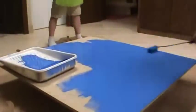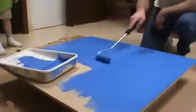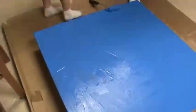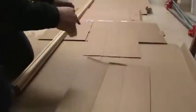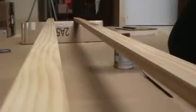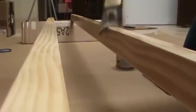To paint the table top, we used a combination paint and primer in one with high durability and gave it a couple of coats. This is a perfect opportunity to get your kids involved because painting is fairly easy and it doesn't have to be perfect. I wanted the sides of the table to have just a slight shine to match the look of the cabinet, so I set them up on makeshift cardboard sawhorses and gave a light coat of polyurethane before cutting them into smaller pieces.